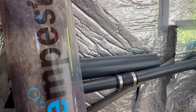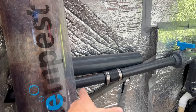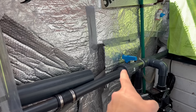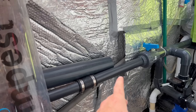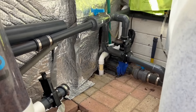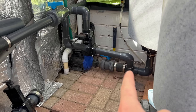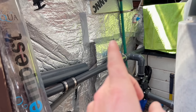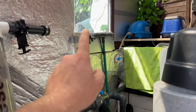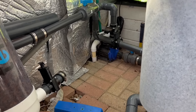We're actually going to be fitting a new ball valve so any maintenance he does to the pond next time can be shut off from the pond wall - something he wishes he'd done to start with. So our first job is to move the nexus, come out of the nexus into the pump, return it back to the pond wall, and then hook up the tempest from the skimmer line to feed the UV and the shower. We're going to crack on and get the job done.